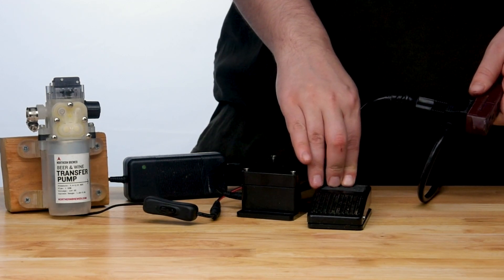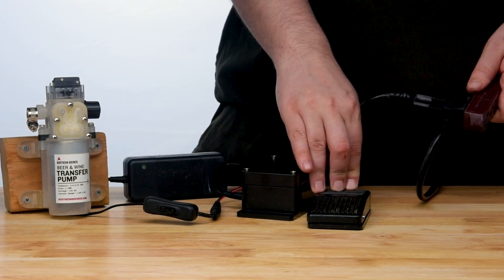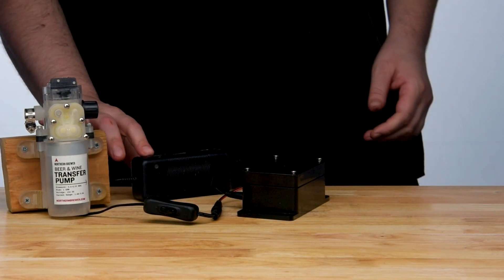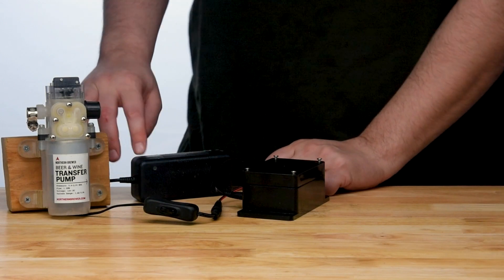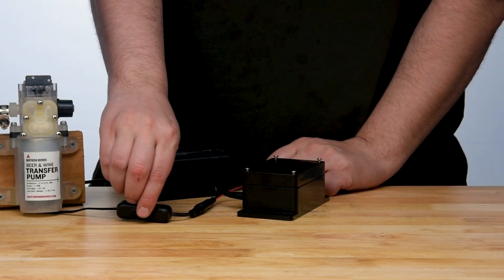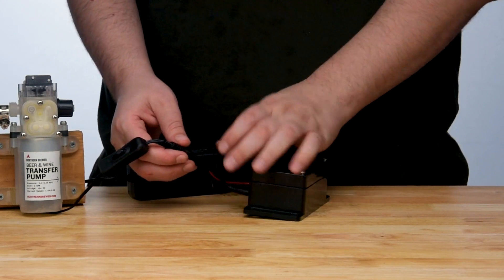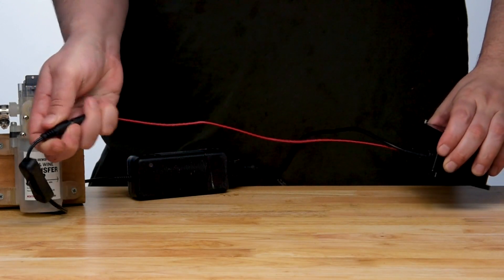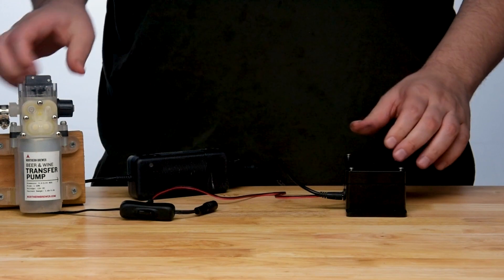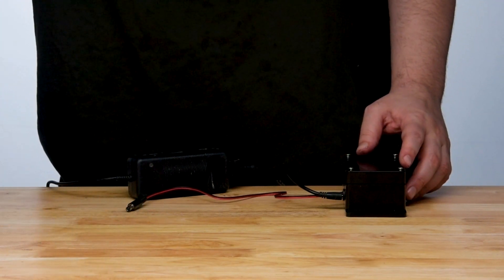Be warned, though, because the power supply is not really meant to be treated like this. You will notice there's a delay if you rapidly turn it on and off — this is a self-protection mode that prevents it from damaging any equipment further down the line. Even though we highly encourage the use of a foot pedal, and there's another inline switch in the control box, this switch is also really important, as you shouldn't plug the pump in until you are ready to turn it on. This prevents misfires and activating the pump when you don't mean to if you bump into the foot pedal.